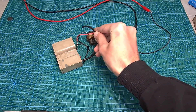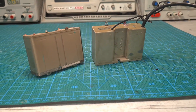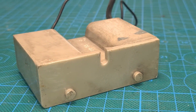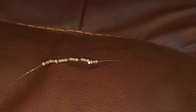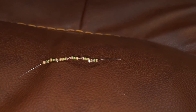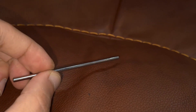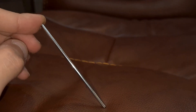Our multiplier poses some danger because it lacks a discharge circuit. In other words, after disconnecting the power, the capacitors of the multiplier will store a charge — if you touch the output, it will give quite a shock. Therefore, a high-resistance discharge resistor of 50 to 70 megaohms is connected in parallel to the output of the multiplier. In my case, this is a chain of six resistors connected in series, each with a resistance of 7.5 megaohms, giving a total resistance of 45 megaohms. As output electrodes you can use prongs from a regular plug — I used guides from an old disk drive.